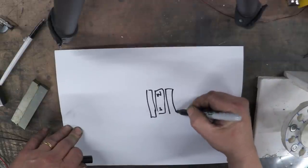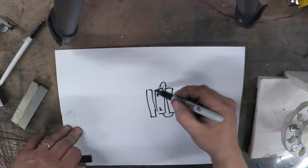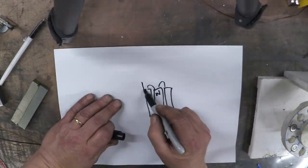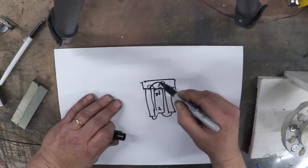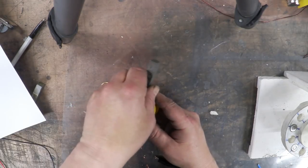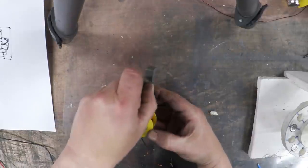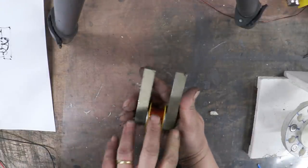The way this operates: we have our magnet with north and south poles surrounded by a piece of steel. The magnetic flux can travel through that steel flux circuit. If we put a lump of steel on top, the magnetic flux is held within the piece of steel — and that's exactly what happens when we put those two bars on, completing the magnetic circuit.